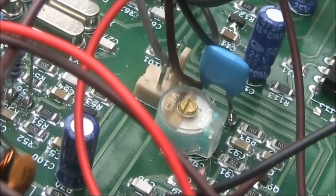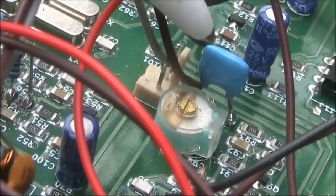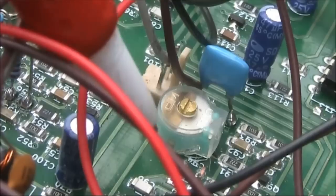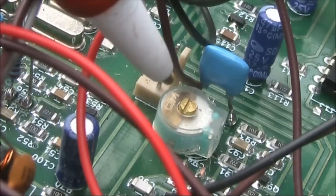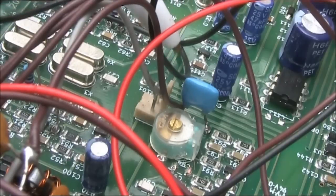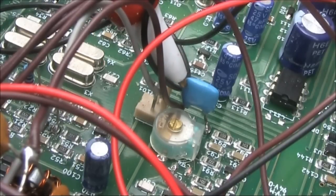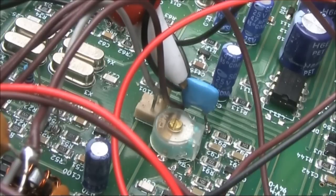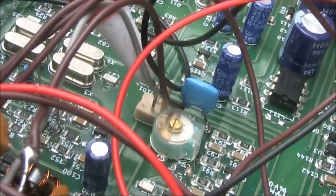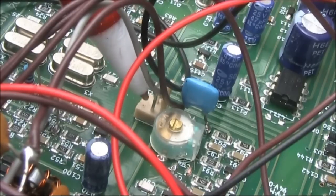This is a close-up of the ceramic resonator mod. The ceramic resonator is installed in the same place that the yellow tuning coil was. The trimmer has been set to minimum capacitance to ensure maximum tuning range. The connections from the band segment switch — one goes from the ceramic resonator, soldered straight to the board, and the other goes from ground, using one of the pins for the external VFO socket.